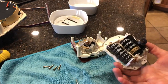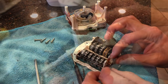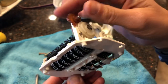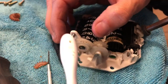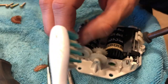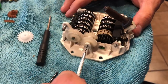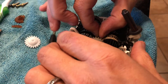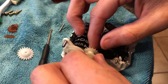Now we've got the gear exposed, which actually broke when we were prodding it — so that was pretty brittle. You can see how when one gear turns, the other one doesn't do anything. We notice there's some dirt in the cogs, which certainly doesn't help. We're going to clean that off — if you have canned air, this might be a good time to use it. Then you can push out that pin and slide it out, and then take out the gears.